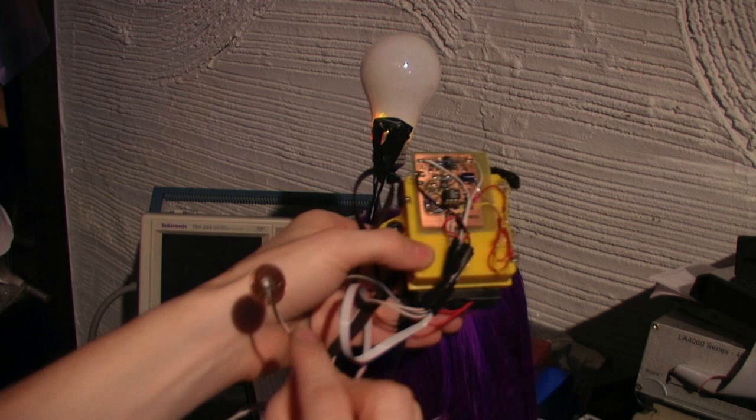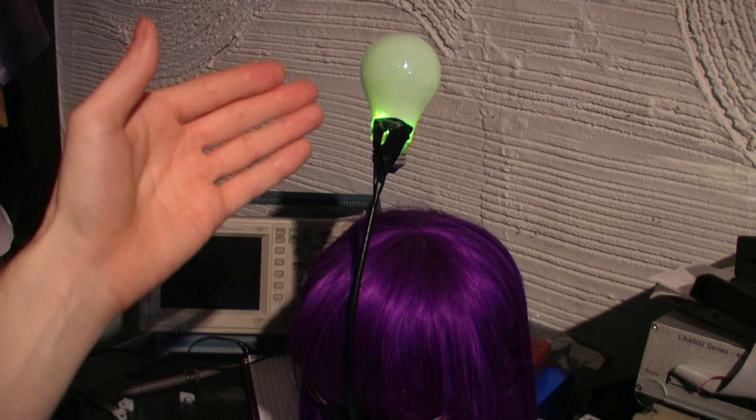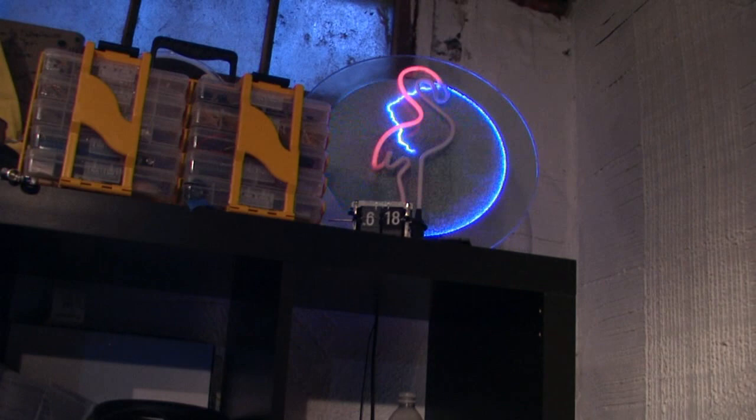There's also a secondary electrode that you have to attach to your body somewhere, which servos against the common mode noise and tries to cancel out some of the terrestrial noise. A lot of this blinking that's going on right now is because I don't have it hooked up to a probe on my body and it's floating — it's actually picking up my plasma disc up here, which is sound-activated.